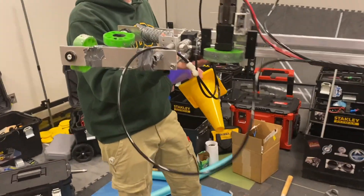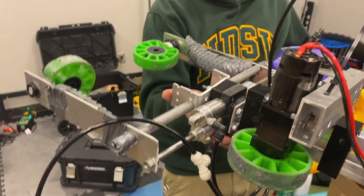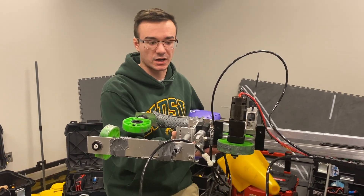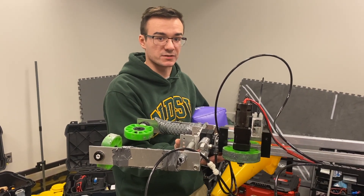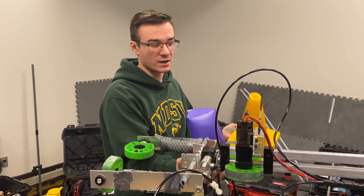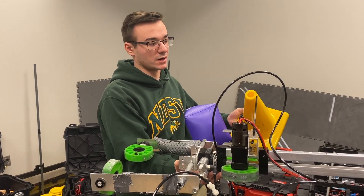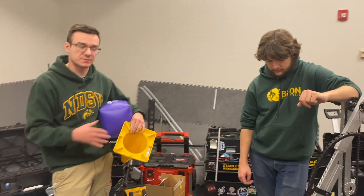As far as the gripper goes, we've been getting a lot of questions both on the live stream and in comments about why we're not using suction this year, or why they've been seeing a lot of suction used in the past. From experience on the team — there's over 40 years of experience between all our members in FIRST Robotics prior to RI3D — there just haven't been a lot of positives to using suction, whether due to air consumption or the complexity of the systems by comparison.